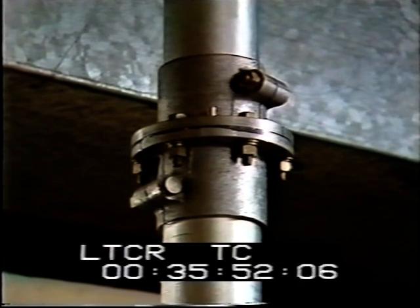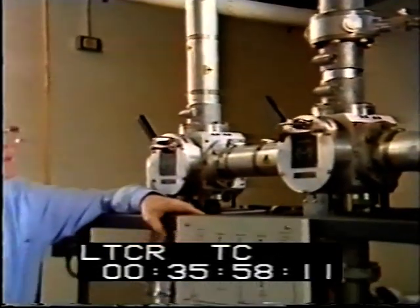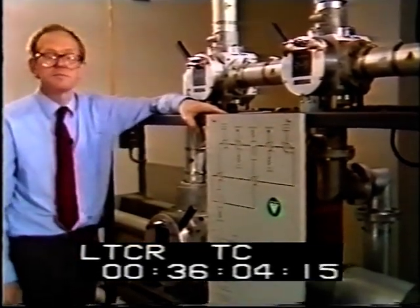The combined vision and sound outputs from both transmitters in the case of a parallel station are fed to the feeder switching frame. At the top of the mast, there are usually two aerials, known as the upper and lower stack.